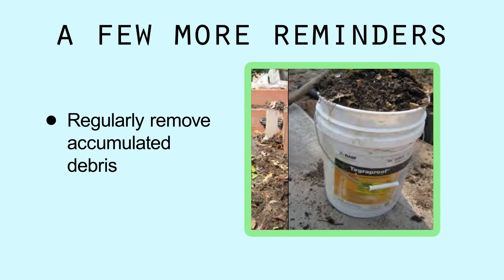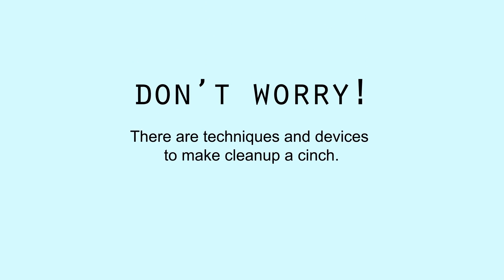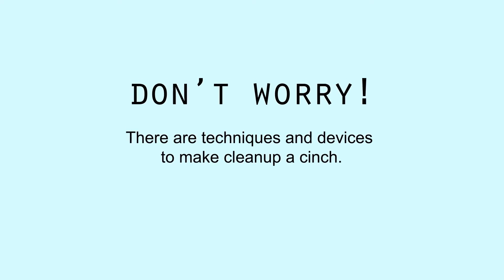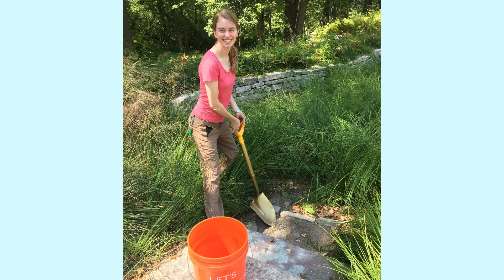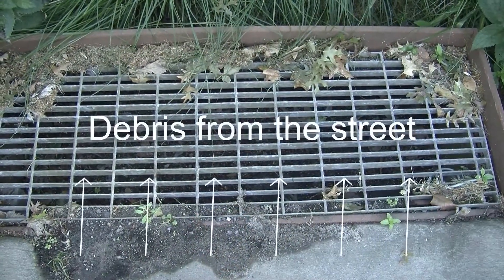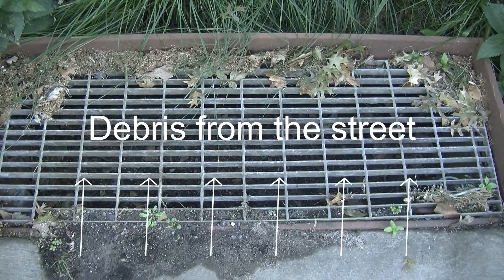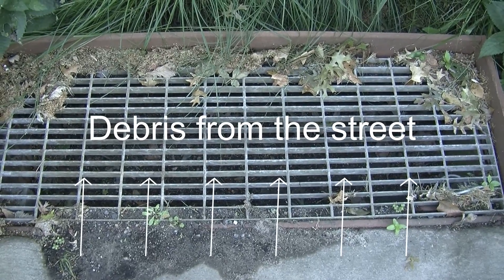Accumulated debris may sound unappealing, but remember, this is a top benefit of the rain garden. Preventing this gunk from damaging lakes, streams, and wetlands is what it's all about. There are techniques and devices to make this cleanup a cinch. For rain gardens catching runoff from roofs or driveways, often the best tool is a shovel or gardening spade. Carefully shovel out any sediment, leaves, or trash and throw the debris in the garbage. One of the challenges with curb cut rain gardens is the amount of debris that gets carried into them from the street. Check with your city to see who is responsible for cleaning out the inlet or pretreatment device.